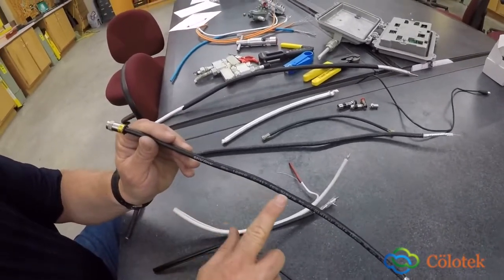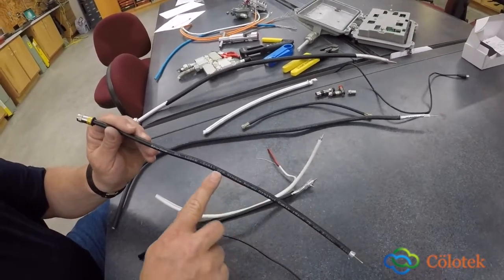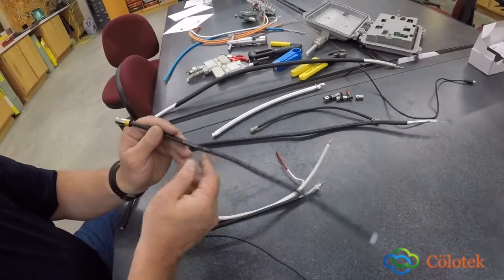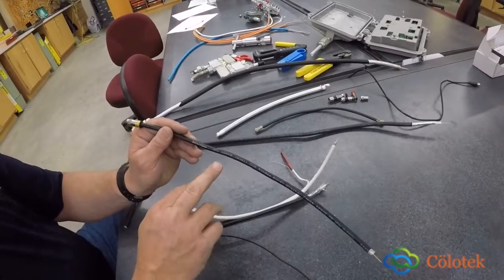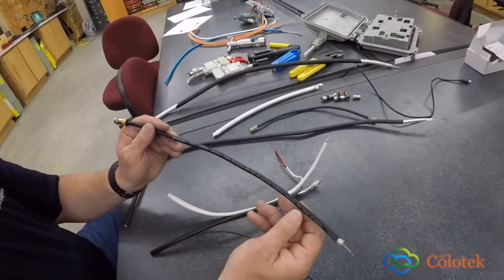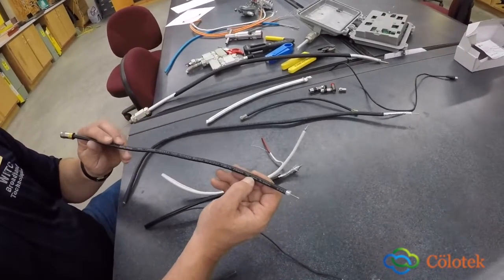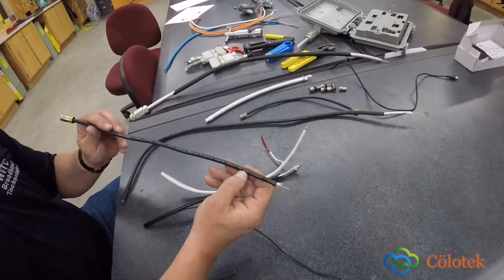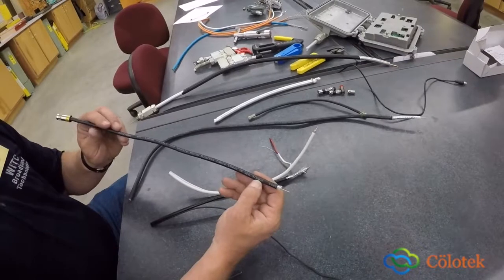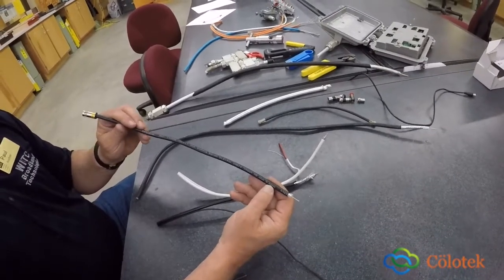We have identification markings, just like in the twisted pair section. We also have them for coaxial markings. These markings are, for example, here's the manufacturer. It'll talk about footages. It's going to talk about the different types. And it'll also give you a 75 ohm characteristic. That's the characteristic impedance of this cable, which you'll get into a little bit later in other modules. Also, it's going to tell you the bandwidth capabilities. This is capable of 3 gigahertz bandwidth transmission.